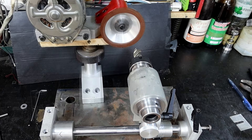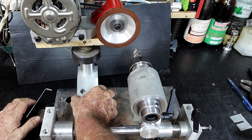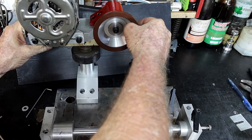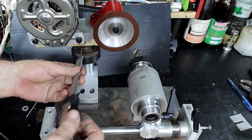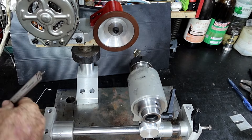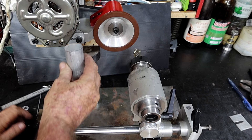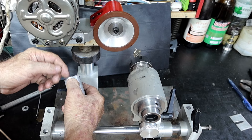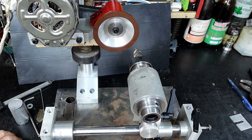Just give me a moment to bolt this motor on here. What I'm going to do now is figure out where that's going to bolt and where this hole's got to go. I think I can actually move it back a bit from where it is - probably 12, 12.5, 13 mil from where it is. So the next step is to put that hole in here, then machine up something that goes up into that hole - put a 20 mil hole up through this, leave it blank at the top so I can thread in my adjusting screw to adjust it up and down. I've been at this three and a half hours this morning and it's nearly lunch time, so I'm going to have a break.